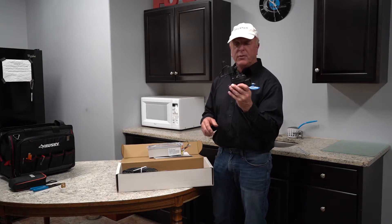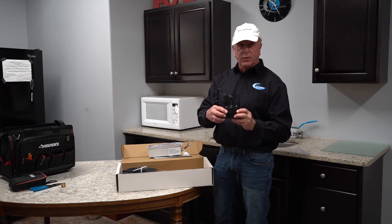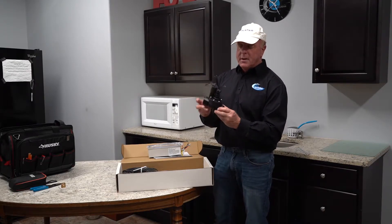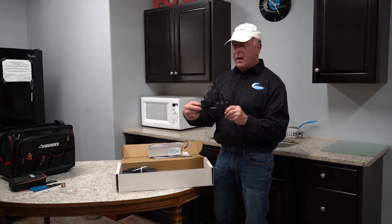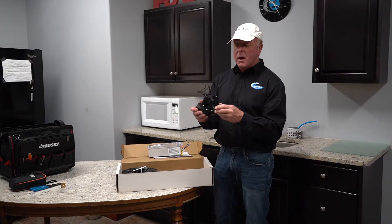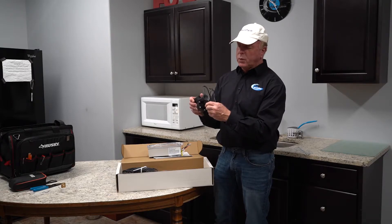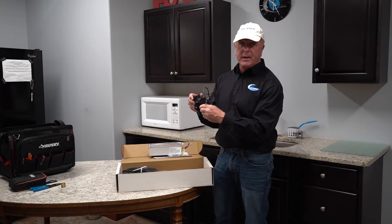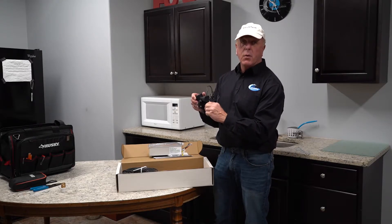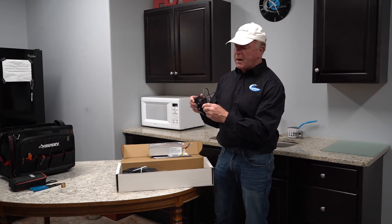We have an autofill valve, and as I've explained in other videos, most importantly this has a direction on it. You'll see a little arrow here. Some valves have an arrow on each side, but basically you're going to put the water supply in on one side and the other side comes out to the pool. On the top of it you have a little knob like a spigot. If you turn it all the way clockwise it's going to close down the water, and if you spin it counter-clockwise it's going to open up the valve and allow as much water to flow as possible.